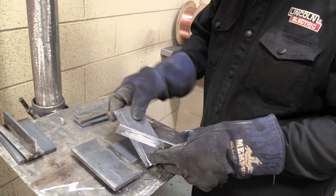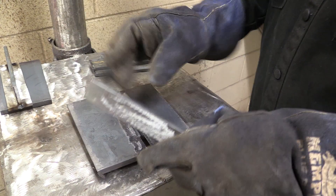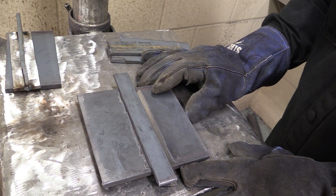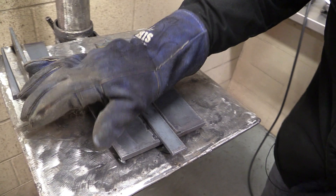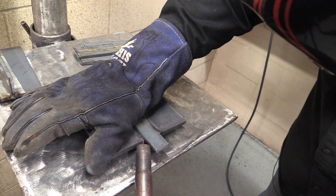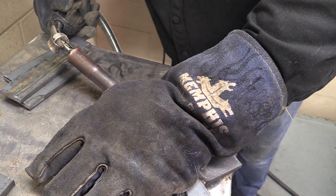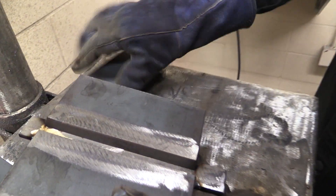Let's go through this one one more time. I have my bevels facing down — we're working with the back of the plates. We need a quarter-inch gap. I know my material is a quarter of an inch so I slide that material in there and very carefully lift it up. I take the ground spot, put it down on the back because this has to be a quarter-inch opening. If I move it around I want to check it again. I hold this thing down and I come in and put a tack on this side, then this side, then this end, one more little tack, and another tack here. When I flip this over I now have that V-groove butt with backing weld.